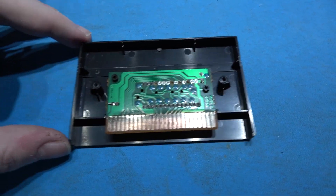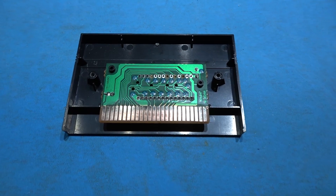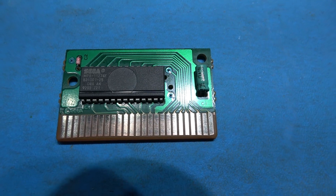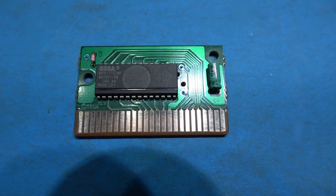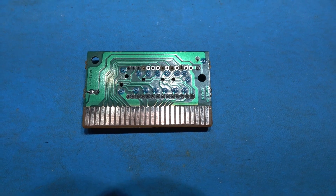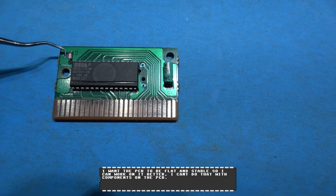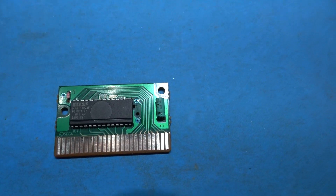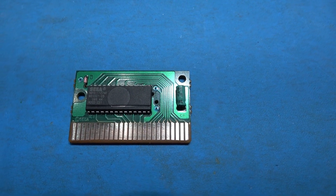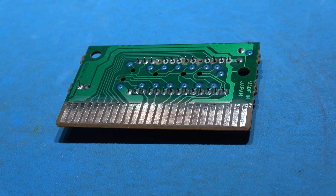So yeah, I'm going to have to see if I can fix this thing. What I'm going to do is get this board out, get it all set up and see if I can at least fix it. And if we take a look at the other side you can see — same again, good old sandpaper, works every time, f***ing morons. To try and fix this, what I want to do is just remove all the components: get rid of the mask ROM, get rid of the bypass cap, and get rid of the series capacitor. I'm going to remove these components because I want to work on the PCB without them on there. I'll remove them all at my desoldering station.